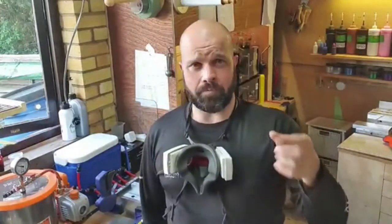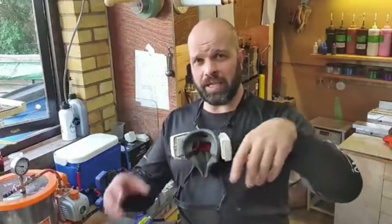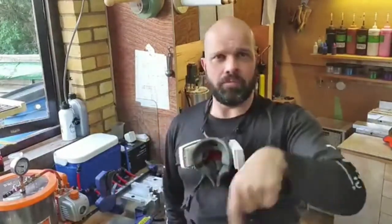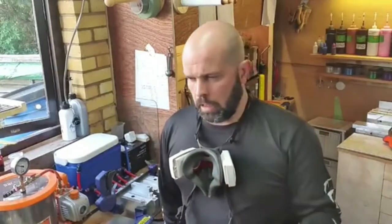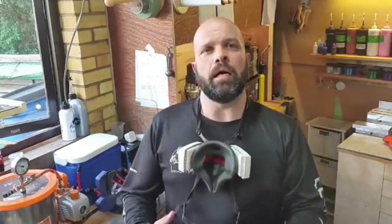But that's about it. If you do get bubbles come through, you see me with the torch, that's hitting the surface to get the bubbles off. As they're coming up, I just hit them and they're gone. There are ways of doing it. Once you cook it, let it sit. Let the bubbles come out naturally. Hit it with the blowtorch. So hopefully, Ian, that answered your questions. Cool.